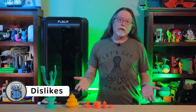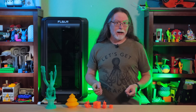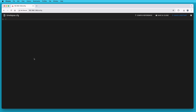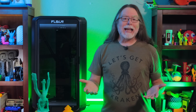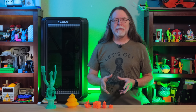Now that I've covered specs, features, and print quality, I'll go over what I like and don't like, starting with the dislikes. The somewhat deceptive build volume numbers is clearly one. Another is that I don't think the T1's AI camera is doing anything AI at all — I don't think it's even recording timelapse videos. The touchscreen says it saved a couple, but there's no way to download them from the T1's Mainsail web interface in Klipper. The timelapse config file is empty, and the console occasionally shows 'unknown command: timelapse render.' So for all practical purposes, the only thing the AI camera does is allow you to watch what the printer is doing. I also seriously dislike the noise level — it sounds like a vacuum cleaner, because that's effectively what it's using to blow air down to the end effector. And the print quality really isn't there.